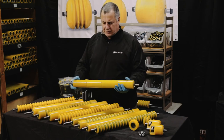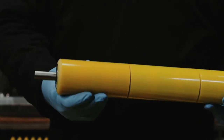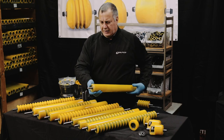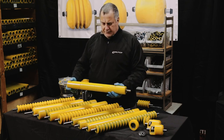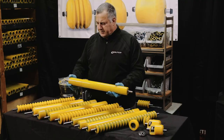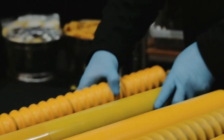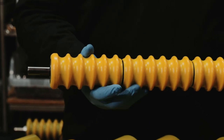We also offer four-section rollers for independent spinning bodies. They have a full bearing and seal setup in each roller body, and steel tube from end to end on each body. They spin independently. The advantage in fairways is if you have a lot of undulations in the turf — any sharp dips, it helps to prevent skidding on the turf. We offer these in a groove pattern as well, with independent spinning bodies.